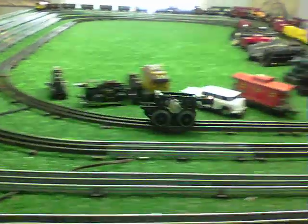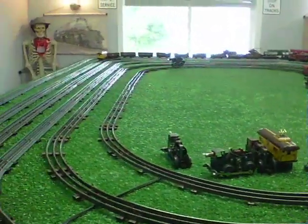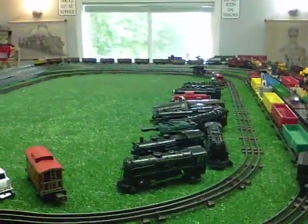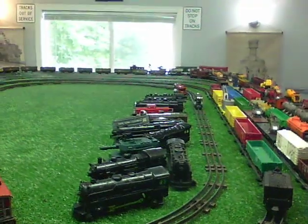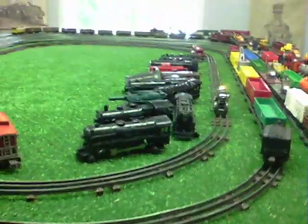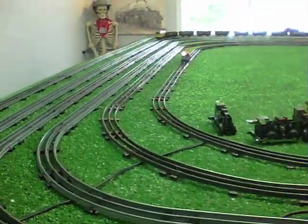Running really well. So these CAN motors will not run on AC — put it on an AC rail, it'll just sit there and vibrate, and it'll just burn the motor up. So you either run them on straight DC, or in this case, just add a diode directly to the motor, and you have an AC locomotive. This will run forever on AC, and it'll still run on DC as well, but it'll now run on AC, whereas it would not before.